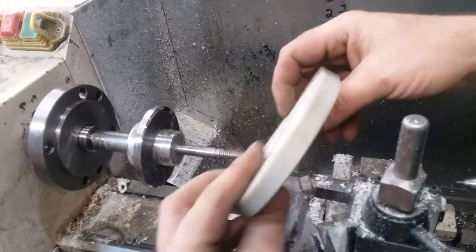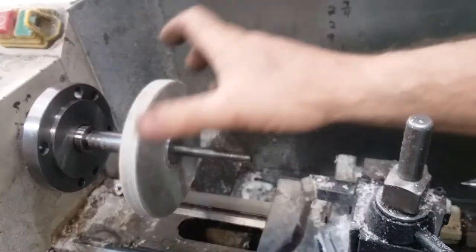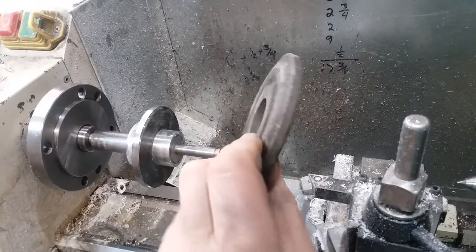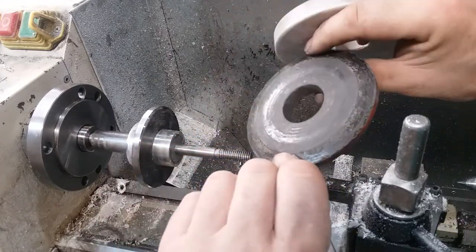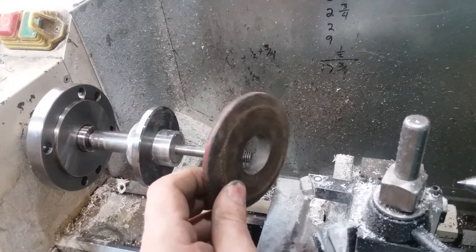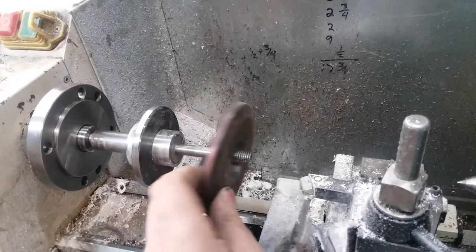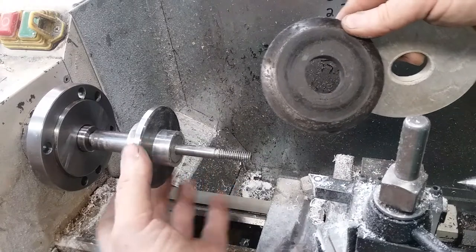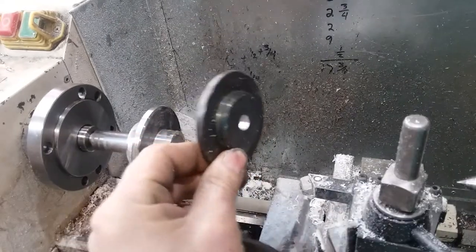So here's our blank with the hole bored in it, and I checked that hole fits the shaft on the tiller very well. And I should mention that this friction disc, this is the original, that is not factory paint. I know that that's not factory paint because this whole thing was painted when I got the tiller. The old man had the engine, the original engine, or second engine, the engine that was on it was the only thing he took inside, and he slathered it with red paint. The engine was shot, and I replaced it, but this is not original paint. But what I was trying to say is the friction disc goes on a hub about that big on both sides. Matter of fact, this is the hub, the washer for the front side of it.